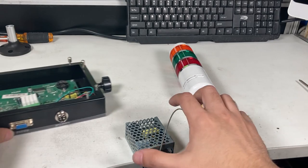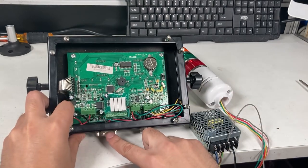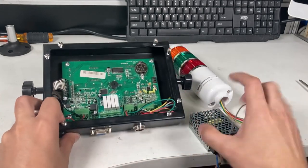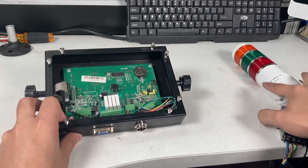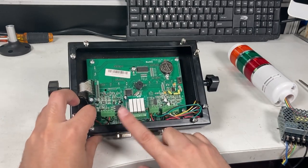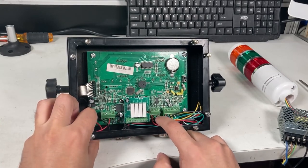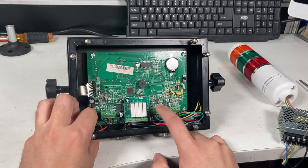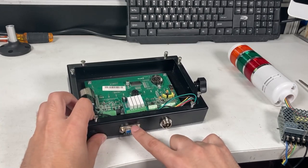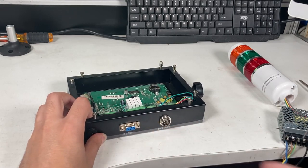I can show you slight detour, I guess, on how we're going to wire this RS232 connection to his board, because you see nothing's filled in right now. So this specific one, it's only going to have one RS232, which is the one on the bottom. Sometimes you might see them with two, because this one still has, see, connects to this red, green, black, transmit, receive, and ground. So if you want to connect to a computer, if you want to connect to a scoreboard, other things, this one's not going to use that. It's only going to use one of these connectors, so you're not going to connect to anything else,